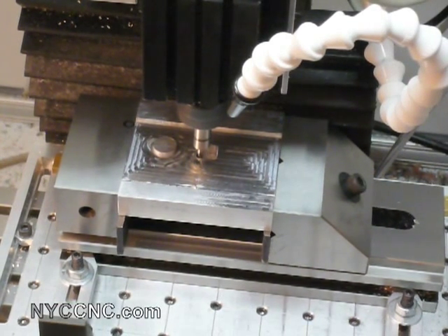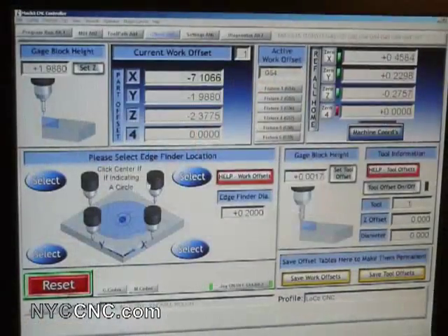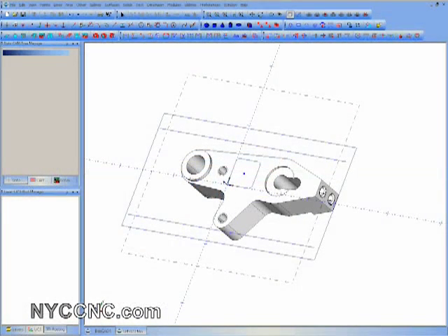I'm going to do the same with my X on the edge — just checking in on that again. Found the edge, move over to Mach 3, click the top right offset, which sets my X to positive 0.1 inch.